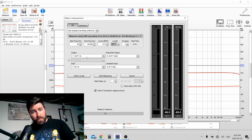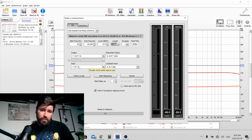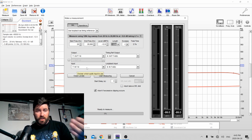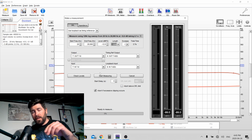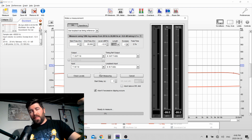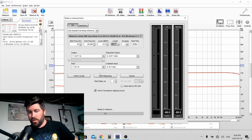So output, that's going to be your channel 1. Your timing reference output will be your channel 2. Input number 1 is going to be the device we're measuring, and then the loopback input is going to be our channel 2 as well. So what you want to do here is take output number 1 of your sound card, send it to the device you want to measure, and then the output of the device is going to come back into channel 1 of the interface. Your channel 2 is going to stay linked just as an internal reference.